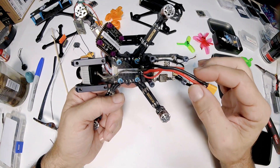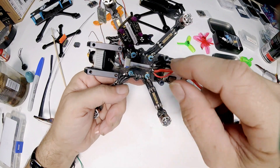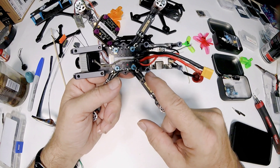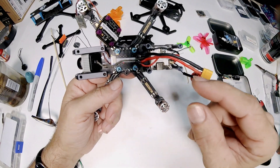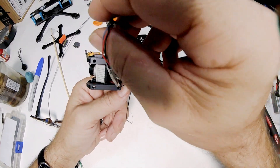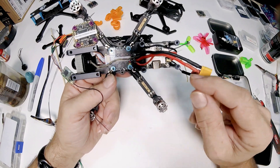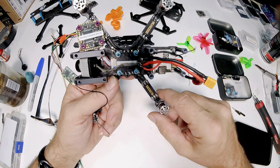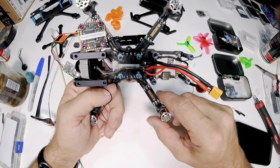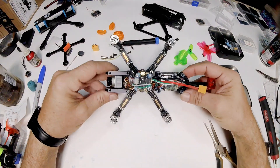I've been looking online and you can buy small four-pin connectors with wires already on them, similar to ESC plugs. I need to buy some four-pin male and female connectors and wire one up to my receiver so I can just plug it in and out and move it from drone to drone. I can do the same for the Vista unit — it only needs four wires: hot, ground, RX, and TX. Swapping by soldering and unsoldering over and over would eventually screw something up.